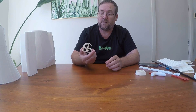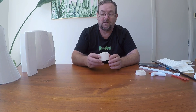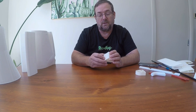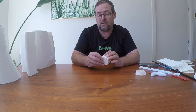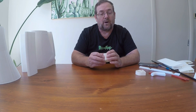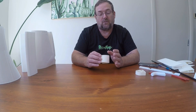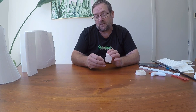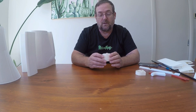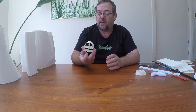It starts off with a test piece. This is the test piece — basically it's about calibrating a printer to make sure it's set up correctly, as well as setting the wall thickness a little bit higher than normal. This is lightweight PLA but we're not printing your standard 0.4 because of the size of this model. Depending on the version, he's looking at doing two versions: one around about 1400-1500mm wingspan, the other about 2m. So we want more strength in the actual design, so the wall thickness is a little bit thicker. It's quite an easy process — I've never done it before but it was quite simple. The other side of that is also ensuring your printer is calibrated correctly so that when it prints an 8mm hole, it's an 8mm hole and not 8.2.